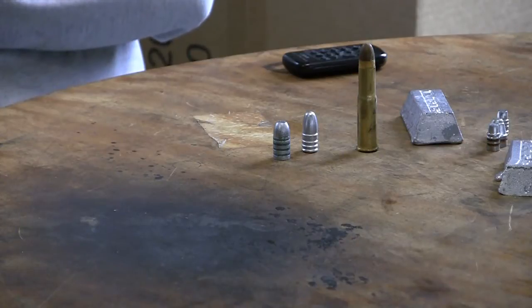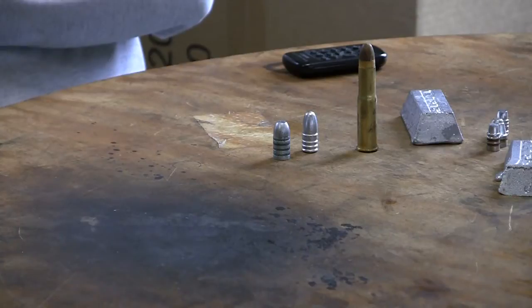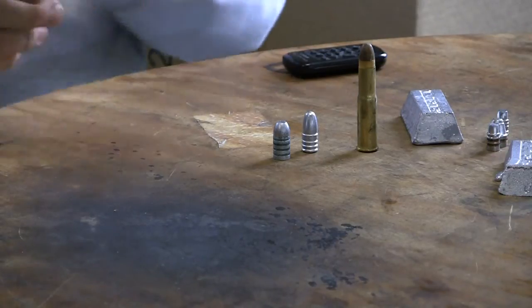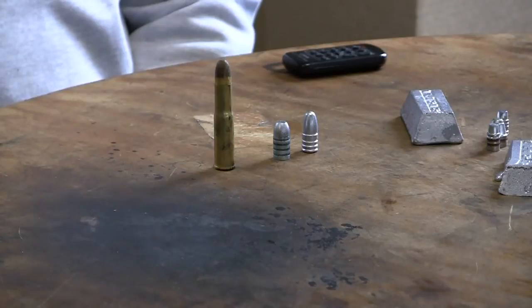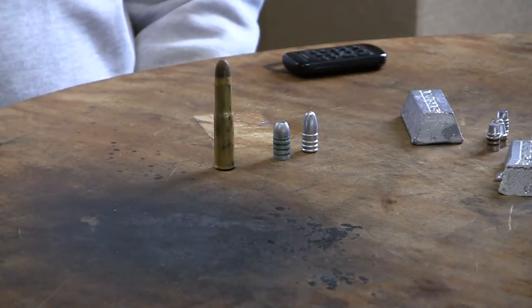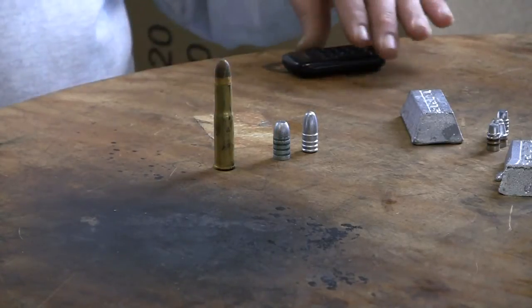A 20-1 alloy means 20 pounds of pure lead to 1 pound of tin — tin is the hardener. You can also go 30-1 or 40-1, meaning 40 pounds of soft lead with 1 pound of tin. I was reviewing something today where someone said the very last alloy used before they changed the cartridges was 16-1, which would be 16 pounds of pure lead and 1 pound of tin. This is a bit exhaustive but I'm doing research trying to get to the bottom of it.